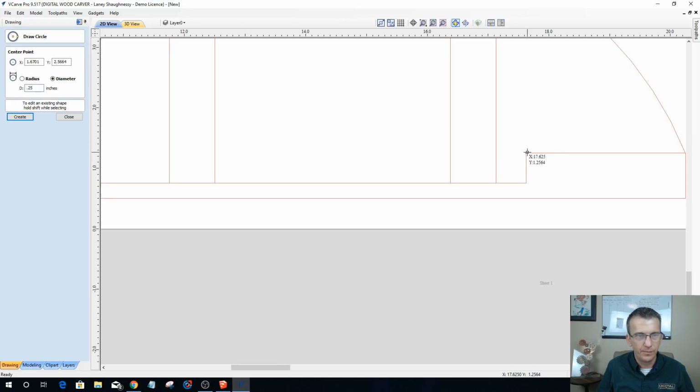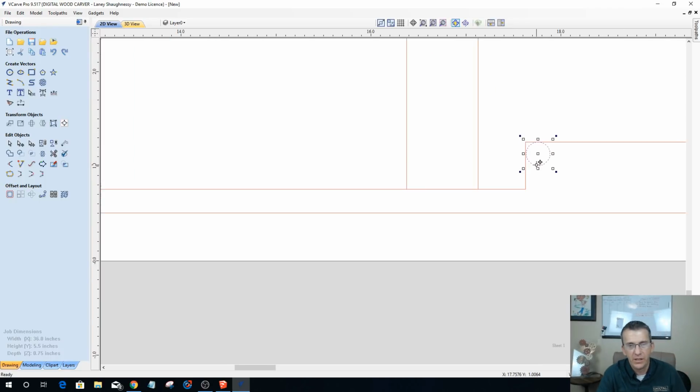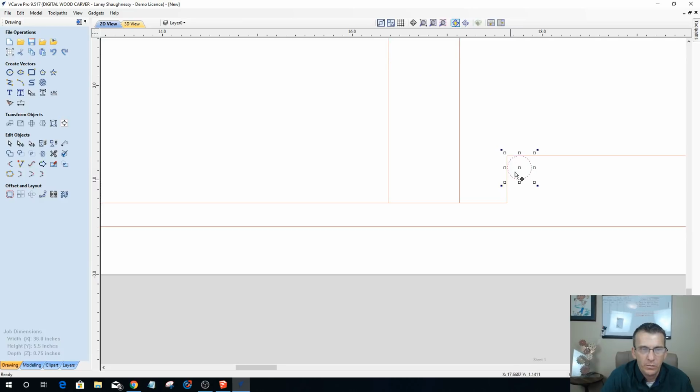And so let's pop a 1/4 inch end mill there. And when I'm cutting out this pocket, I'm going to get a radius there. Now I do not want to radius the front bottom of my board, that top board that goes in here. I want it nice and square. So what I need to do is create a fillet here, a place for that router bit to go, but it still provides me with a square corner. And yes, I'm going to have a fillet on the inside, but it's not going to be noticeable. It's not even going to hurt anything aesthetically.